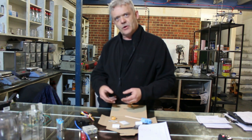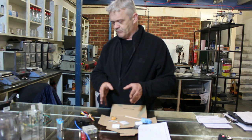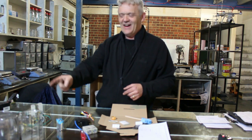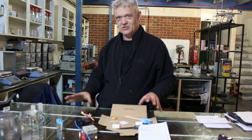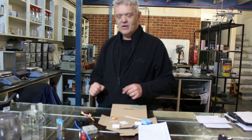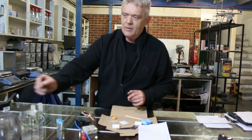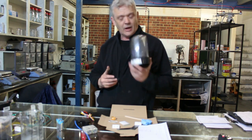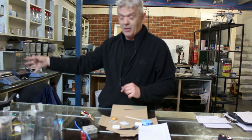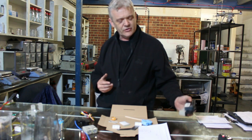These flakes need a little bit of further processing, but it's really simple processing. The better way to do it would be in a sonicator bath. I'm really tired, actually, because we're doing tons of things, but as Patty said, we have a commitment to this so we're going to do it. Now, I know a lot of people don't have a sonication bath and don't want to spend on one because it can be a bit expensive. So we're going to also do a mechanical system where we use a blender — an ordinary kitchen blender. The power supply you're going to need is either a power supply or a 12-volt battery. Here's a couple of little 6-volt lead acids — connect those in series and you'll have your 12 volts.